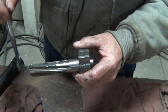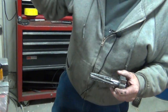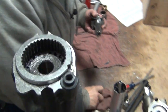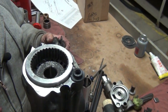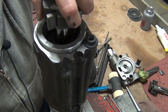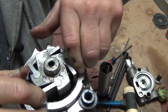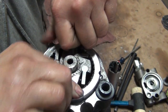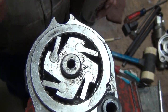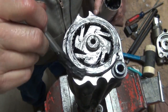We'll want a little bit of grease on the rifling, and then a little bit of grease on the inside of the ratchet ring. Now once you grease all this up and put it together, when you first go to test it, it may run just a little bit slow for the first minute or so because of the grease, but the grease still really needs to be there. Slide this in, close the holes in, then carefully turn it and it'll eventually find its spline and drop right in. Put a little grease around it and on the top — no dry spots.